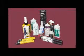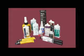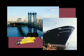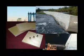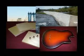Having selected the pull-off tester to be used, the next step is to identify a suitable adhesive for bonding the dolly to the coating. When selecting an adhesive, it is important to consider the expected bond strength and the nature of the coating and dolly. Specifications for most coatings are typically less than 1000 psi. Thermal spray coatings are tested higher, though new standards quote acceptance levels at 1000 psi or less.